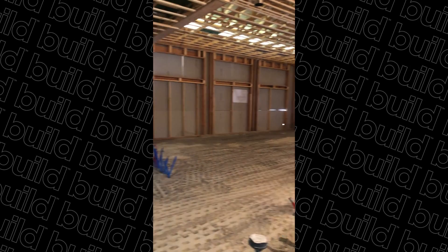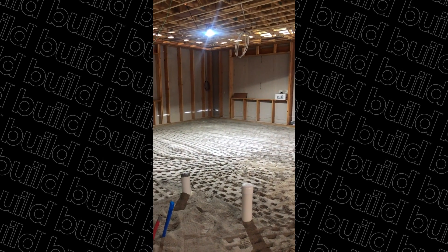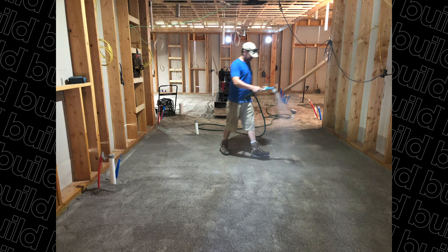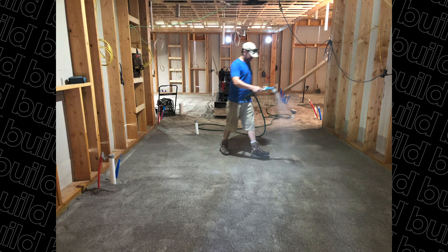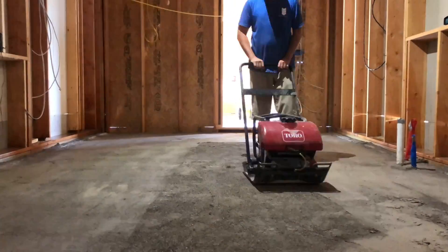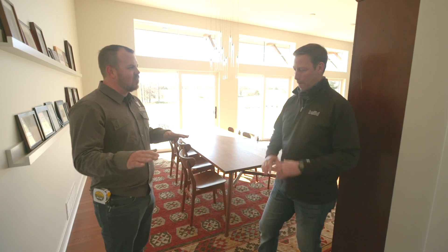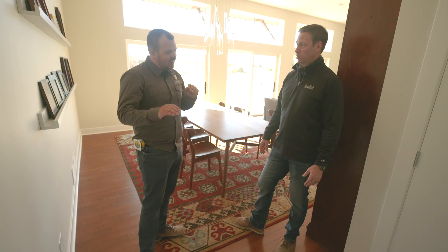The inside of the perimeter wasn't disturbed, as our excavator likes to say. Then we have compacted aggregate — a lime waste byproduct, basically road base. It's very fine material; once it gets wet it locks in place and compacts just like sand. We graded it perfectly flat. We actually joked that this was the flattest substrate we'd ever built on — laser flat and compacted — but no concrete.